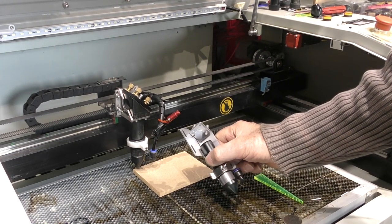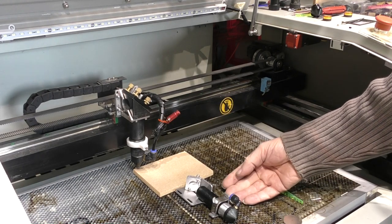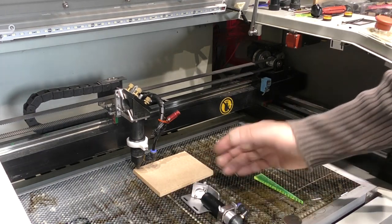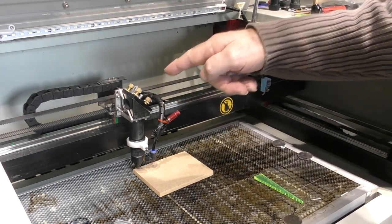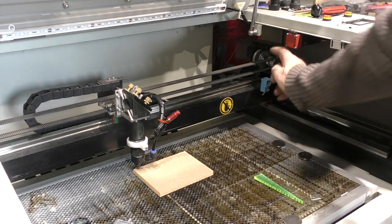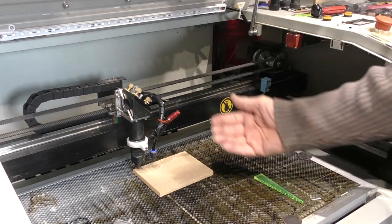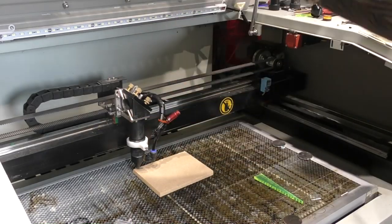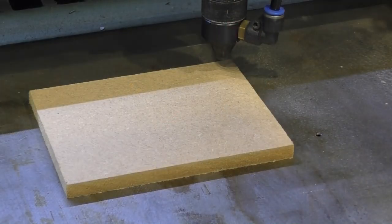Here, we've got a very lightweight, half of nothing, weighing just a bit more than a feather. You're going to be able to get that to 2 miles an hour virtually instantly. So there's going to be no delay in getting this up to 2 miles an hour, and there's going to be a long delay in getting that up to 2 miles an hour. You are a fixed amount of power, and you can only impart a certain amount of energy to that mass. And if you impart a certain amount of energy to a big mass, you will eventually get it up to the speed that you want, but it will take longer. The smaller the mass, the quicker you'll be able to get it up to speed.